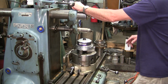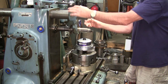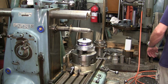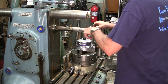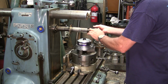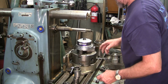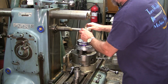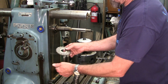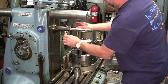Now, just to start off here, we're going to go ahead and pull off our arm here, that way we've got some visual that we can look at. And we know we're not going to be using that cutter there, so we can pull this off of here. Now, before we actually, well, we can change that. We know we're going to choose this stagger tooth here, 150 thousandths roughly on the width.